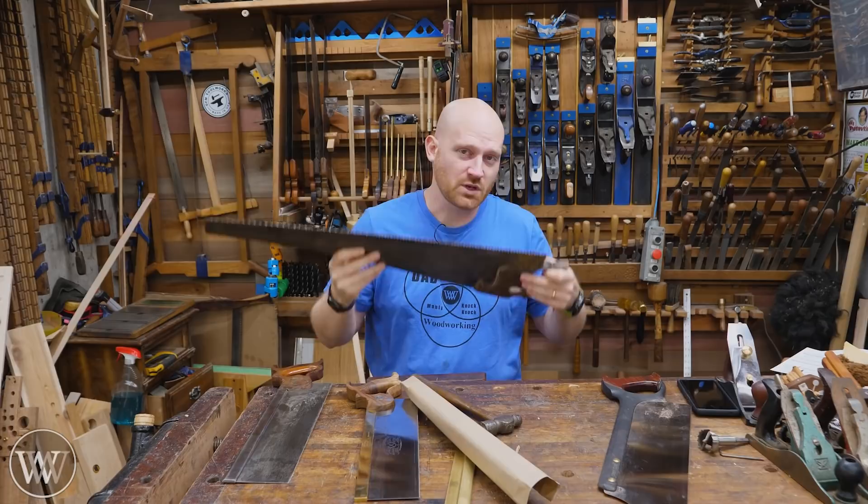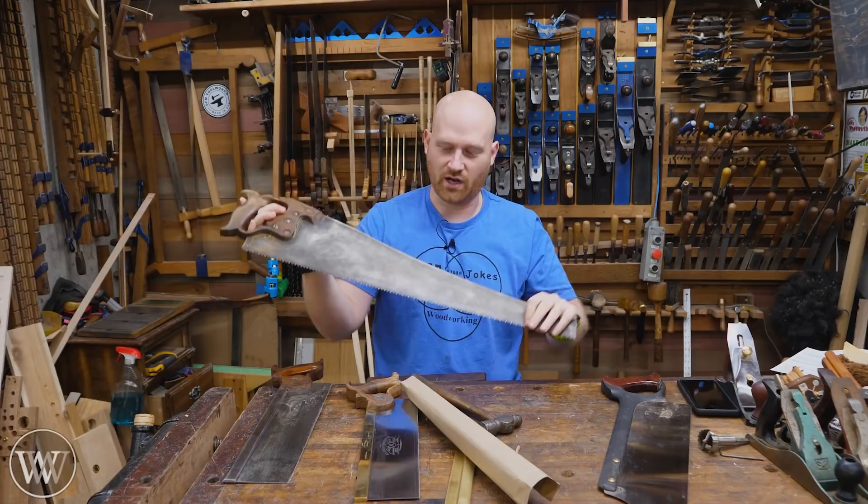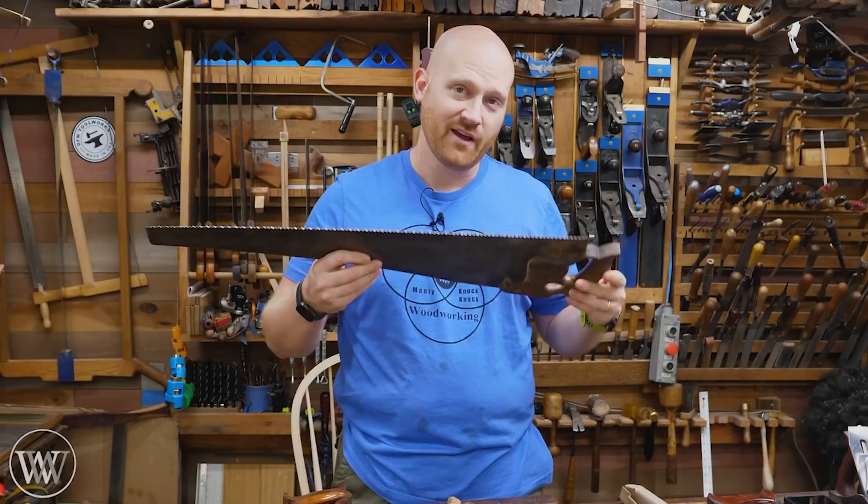With general bends, don't be afraid to tweak them — it can take a lot of force. Sometimes on these plates, if I really need to, I'm going to put it down and bend this handle all the way back around to the toe. You're not going to hurt the saw. You'll just find that you bent a little too far, so you bend it back the other way. As long as you do the same amount, you're going to take that bend back out and now you've got a straight saw.